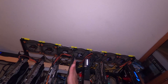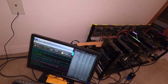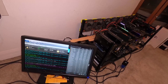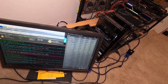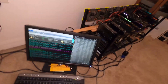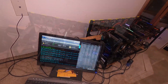Next I want to put the 1080 Ti — an open-air card — next to the 3080 and see if that impacts temperatures as well. Let's get an average for what the 1080 Ti is at currently: we're at 50 degrees Celsius with my current aggressive fan profile, averaging 51 degrees Celsius and hitting a maximum of 53 degrees Celsius. Let me swap those cards over and see how that impacts the 1080 Ti.